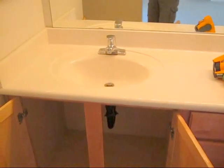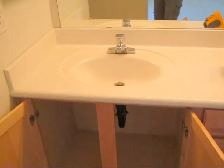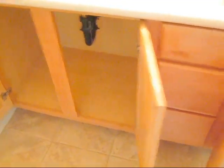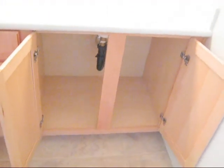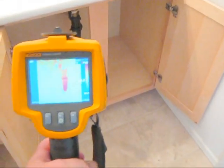Also letting the water run for a good 10 or 15 minutes. Sometimes you have an unoccupied home where nothing's been used for a while, and it's very hard to find leaks. We'll run the shower and try to get a little water in the pan if it's low to drain. We'll look underneath the sinks for leaks, and we will also go downstairs and look for leaks — not only with our eyes and flashlight, but with a thermal imaging camera.